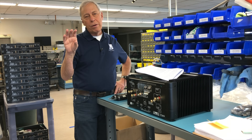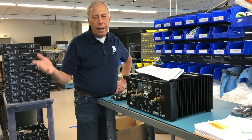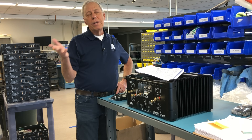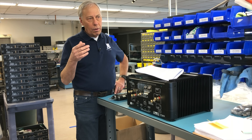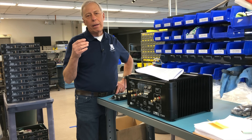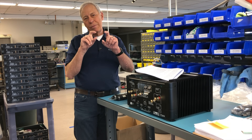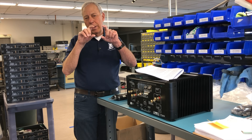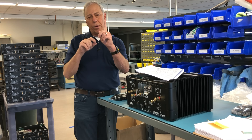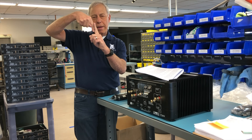Find out what the clipping point of your amplifier is — let's say it's two volts for easy math. You could get two Zeners rated at 1.8 or 1.9 volts, something like that, and put one going one way and one going the other way. You know they're directional, so you put them like that.